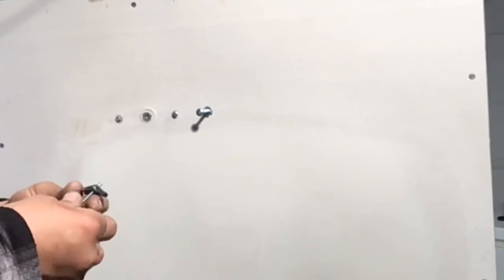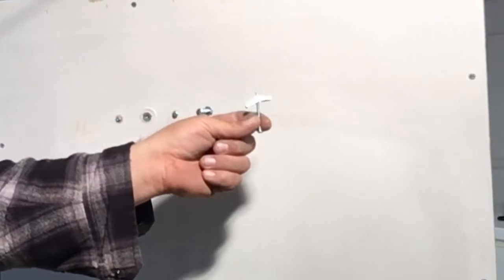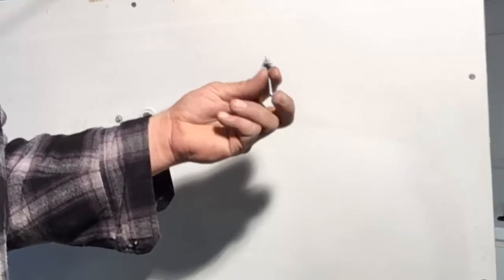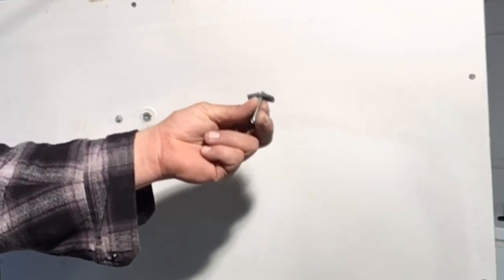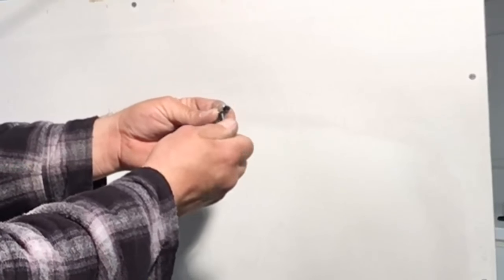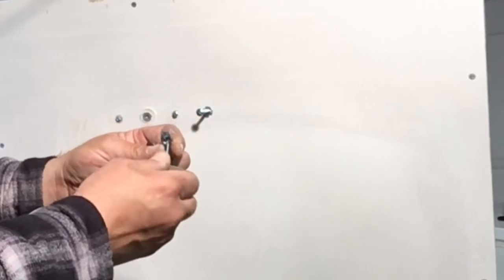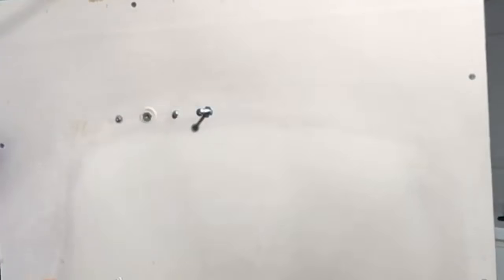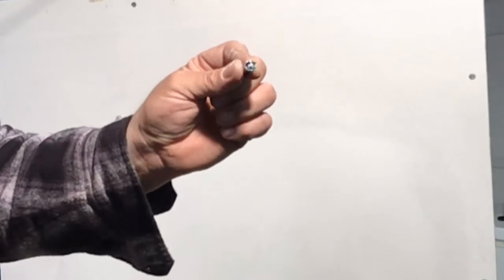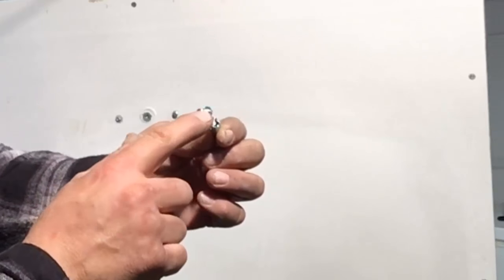If you remove it, the little wing nut will fall off the back of the wall. What you have to do is find a drill bit the same size as the toggle folded over — measure this part of the wall toggle and that's the hole size you want to drill. This one happens to be 3/8-inch, so I'm going to use a 3/8-inch drill bit. We'll drill our 3/8-inch hole and the toggle will fit right into it.